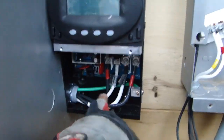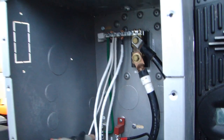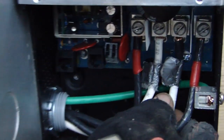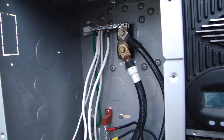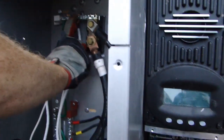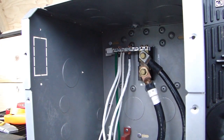The PV negative is just coming off the negative bus bar. As I said before, all your negative loads land in here — they're all connected. This is your PV negative, and this here is your negative output from the charge controller to the batteries. Both battery negative and PV negative connect into the negative bus bar.